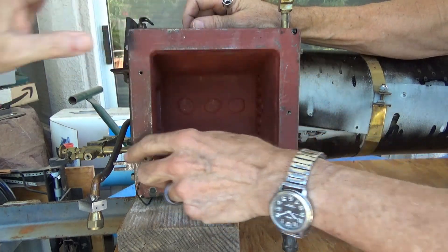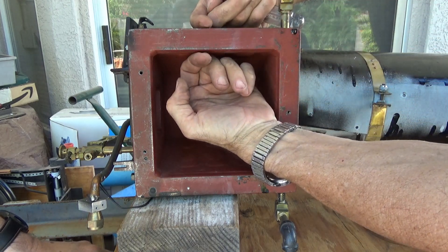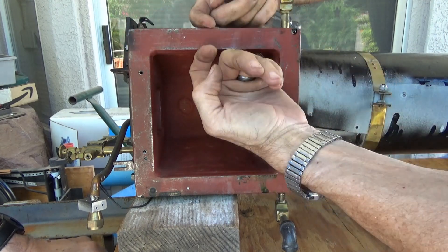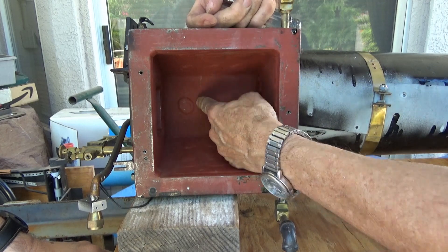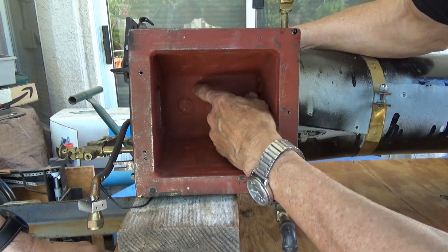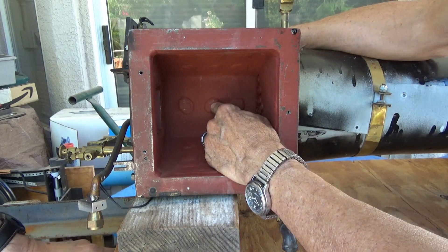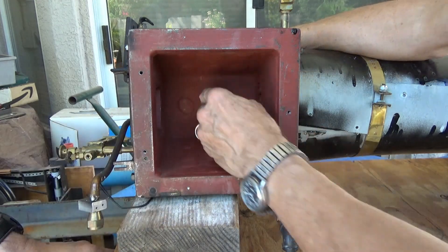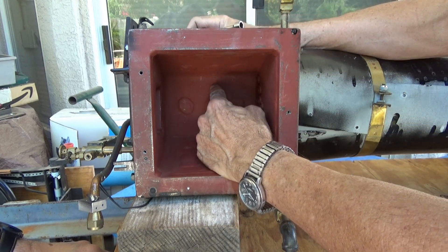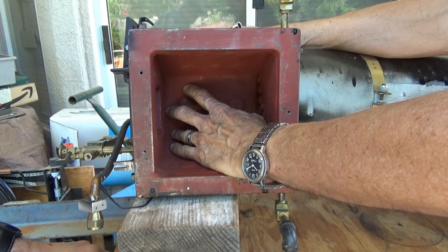The steel boiler — the square ring actually holds the two walls together. So the walls come down like this, the steel ring goes over the top of it. So the inner wall — the top that you see here — is the box. The outer wall goes all the way around and forms the top of the whole boiler above what is called the crown sheet. This is the crown sheet. You don't often see that but you hear that word a lot. And that's where most of the heat is focused then? That's exactly right. And that's why you never want the water level in the boiler to drop and expose the crown sheet. The top of this crown sheet should never be exposed while there's heat in the boiler for any reason.